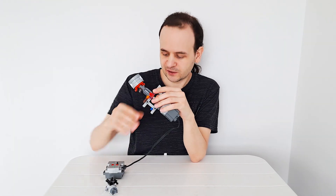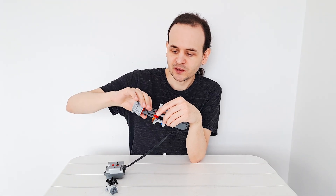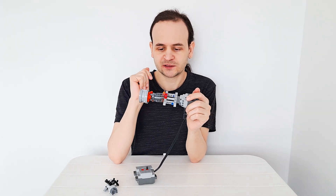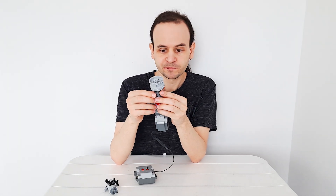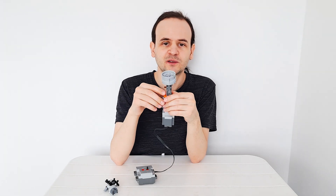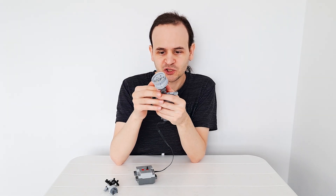The only limiting factor is the CV joint — it is prone to skipping, but only at very high torque. You basically have to stall the motor almost completely to skip it. This is a very useful idea for smaller models — you can get a very compact gear reduction of 3.6. If there's enough demand, I can post STL files so you can try it yourself. I know this has been a bit of a different video than usual, but I hope you liked it. Remember to like and subscribe — thank you for watching and have a nice day.